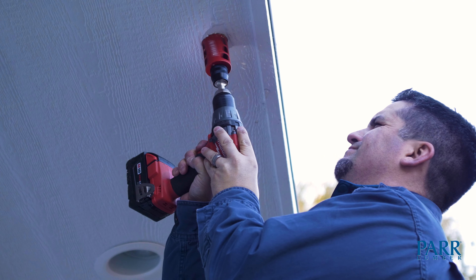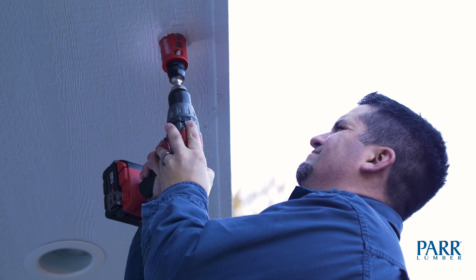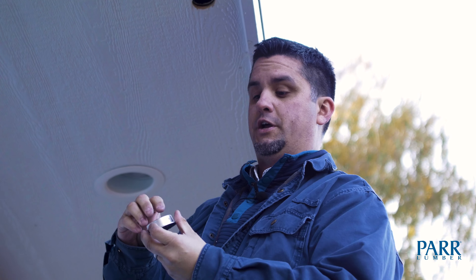It's notable that these mini screen vents come in a multitude of sizes from one inch all the way up to six inch. It's important that when you're installing these louvered mini vents into a soffit, you face the vents towards the house, or in this case our shed.